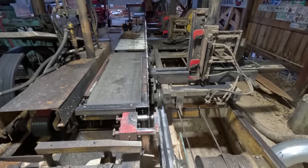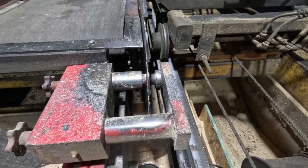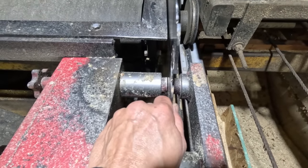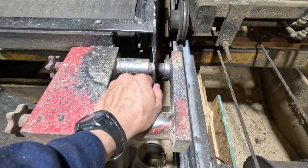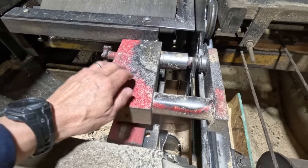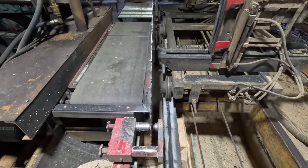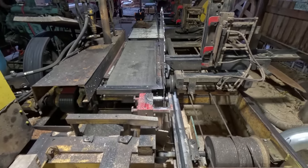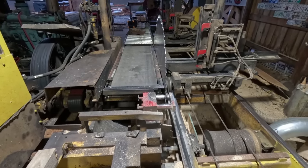We got a concern on this one day. When you're setting your saw guides, they have to be running at full speed. But that's almost too much gap there. You want to split the difference. So when you bring that saw up to full speed, you run your guides in and out. I've had this for 20 some years. I used to run this on the Meadows mill, made by McCormick's saw shop, and they still make them today. So if you have an older mill and you don't like your guides, that is the ticket there.